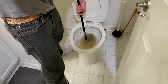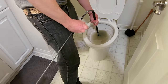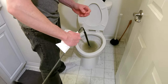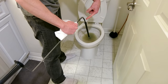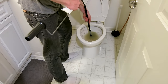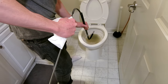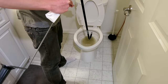Then we go ahead and pull it on back. Be very, very careful on this part — you might want to wear gloves, because this will be wet and that is literally waste, so be careful. The plastic part is okay. Once it's all the way down again, just back it out carefully and make sure that you do not scratch your porcelain. Now, if it's not still clogged, the water is pretty low already, so we're going to go ahead and give it a test flush.